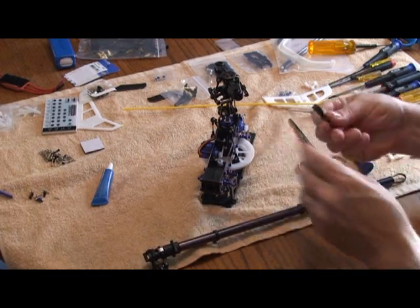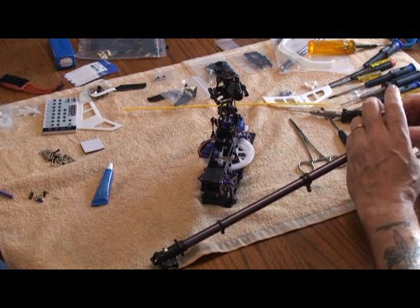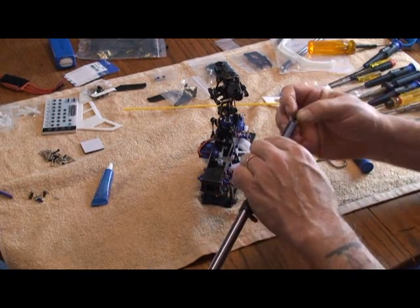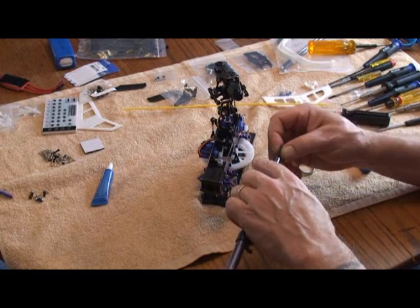Make sure you put your mounts on the same way. It doesn't matter — you can have the servo on the left or the right, it doesn't really matter at this point. You want to make sure that if you turn the belt by hand, there's absolutely no binding or any problems, any clicking or anything like that.